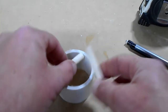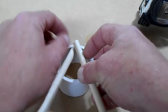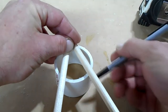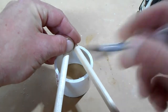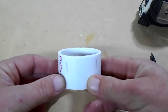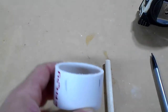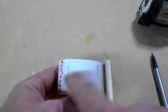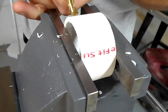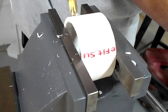All you need to do is lay them on here. This doesn't have to be perfect or precise or anything like that — I've made a couple of them and it hasn't mattered. Just make a mark where your dowels are going to come out at, like so. Then what we'll do is drill two 3/8 inch holes right here. I got this set up in the vise. What I usually do is just start straight and then kind of rock the bit over a little bit and get it to go in at an angle.